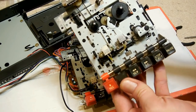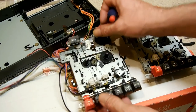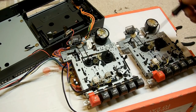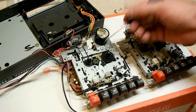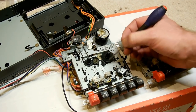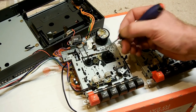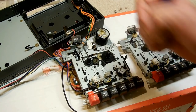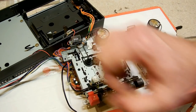The donor idler seems to engage really well, whereas mine seems to be a bit rough. So that is the task: take all this out, get this wheel out, get the spindle off — there's a circlip on top that just pops off — grease underneath as well because that seems to turn a lot better than my one. Get this off, ease the mechanism out, put that new wheel in and Bob's your uncle. Hopefully we get this 464 working again.